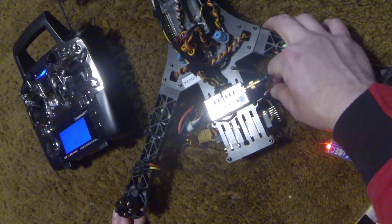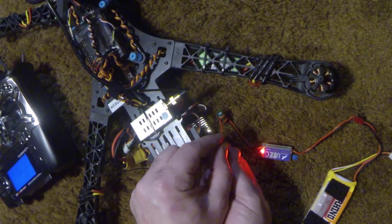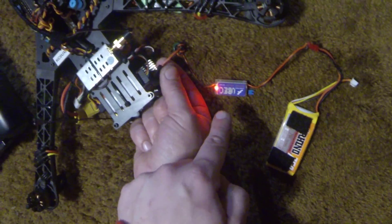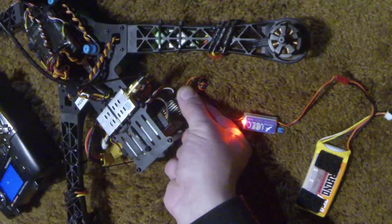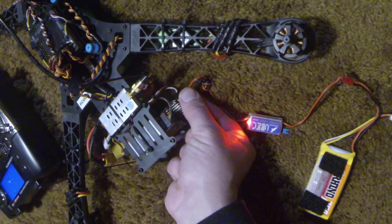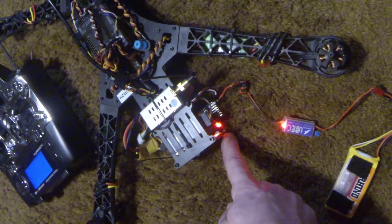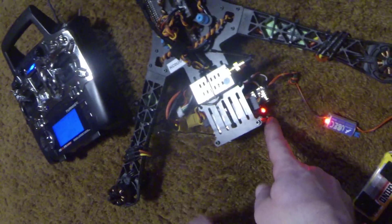The first thing you have to do is pull your single wire off, because that's feeding voltage to the APM. Get an external BEC and go ahead and plug it in. What that does is cause the receiver to link up and stay linked, so now we have a full throttle command coming from the transmitter to the receiver.